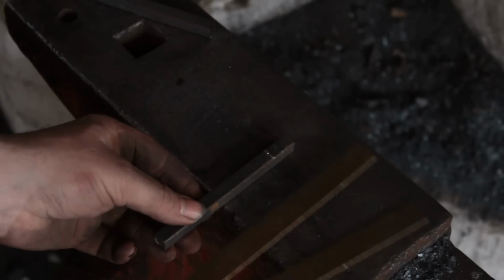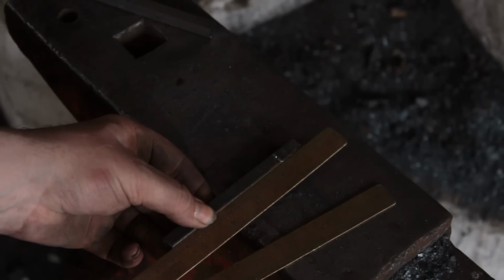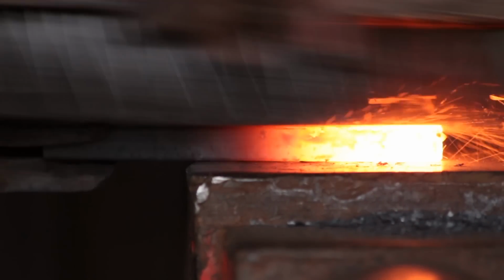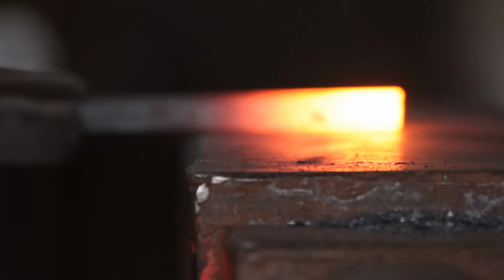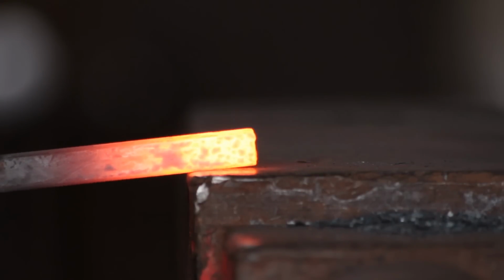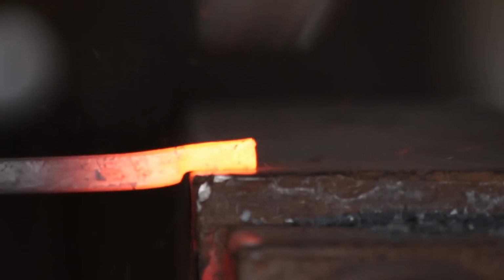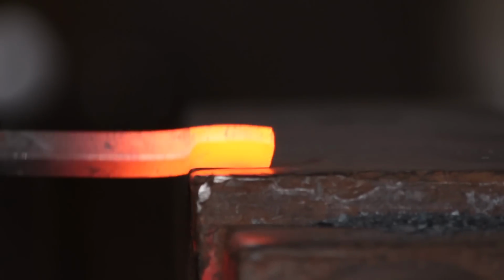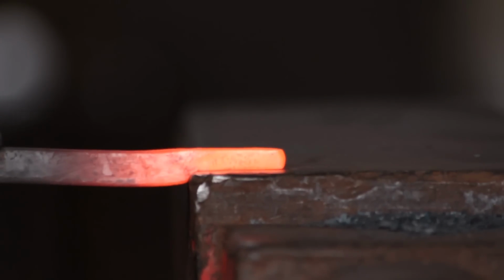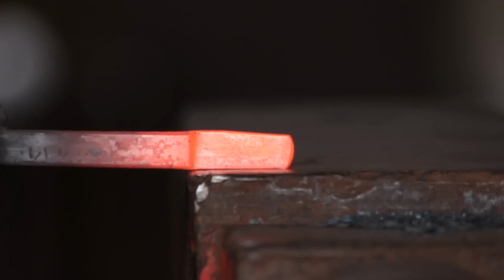So next stage is the central pillar of the rushlight holder. So you're basically making the nibs like tongs. So I've marked off 3/4 of an inch from the end, and I'll set it down like I'm making a pair of tongs. It's exactly the same hinge plate, exactly the same system, but in miniature. Maybe 1/4 of the scale of a pair of tongs, something like that.